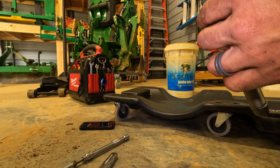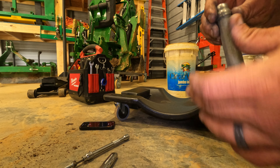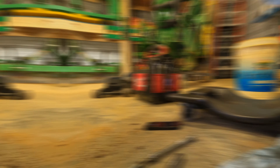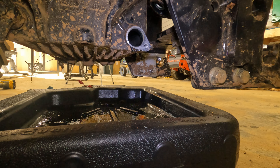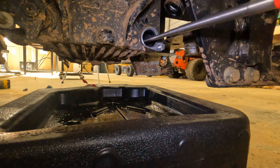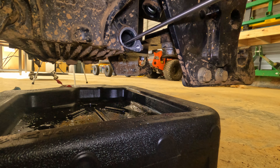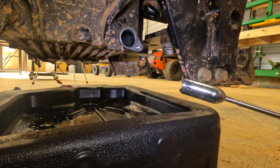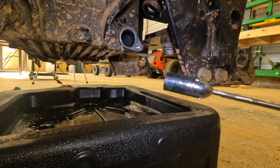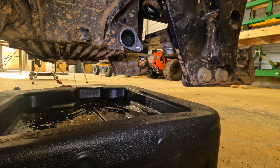So I cleaned this off real good, cleaned all this off and put the magnet back in. Before you put the tube back in - the tube with the magnet - it's probably a good idea to get one of these telescoping magnets and just run it through here to see if you can get any more crap out. Just a few little pieces, not much though - it's not bad at all. Maybe changing the spin-on hydraulic filter at 50 hours helped, I don't know.